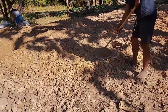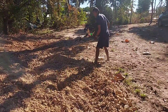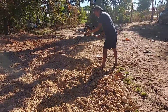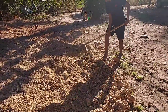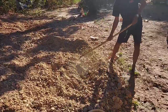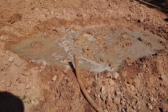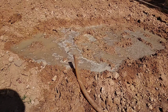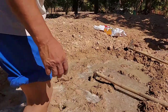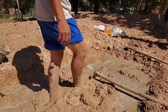To make bricks is not very hard at all. We just till the soil, make the soil loose, and then we can make a dike — an edge around the dirt we tilled to make it into a pit where we can fill up with water and keep water in that pit. It's important to till the soil very loose before we add water because it will absorb water very fast. We add a lot of water to make it cover the whole soil in the pit and then just let it sit wet for the soil to absorb as much water as it can. When the water almost dries up, we walk into the pit. If our feet sink to the bottom of the pit, that means it absorbed very well.